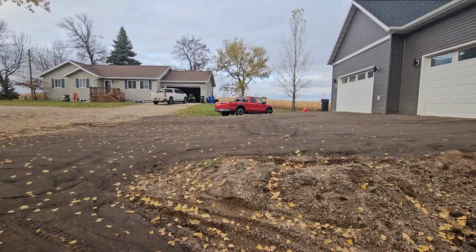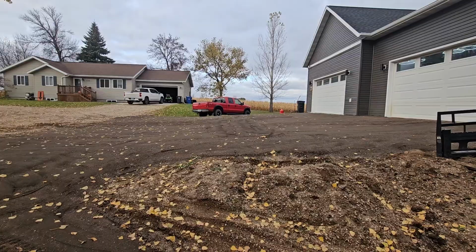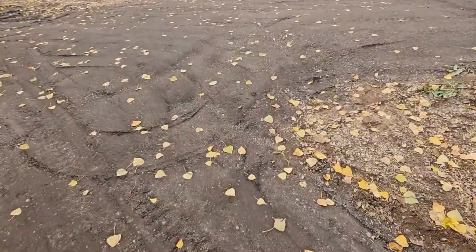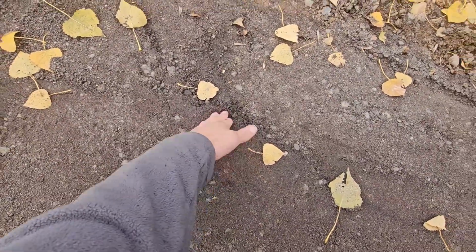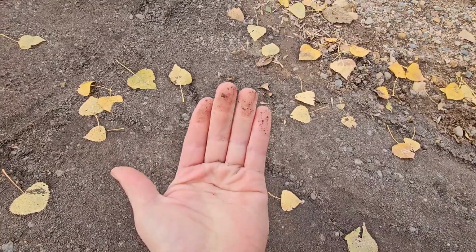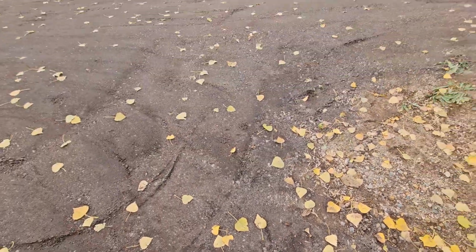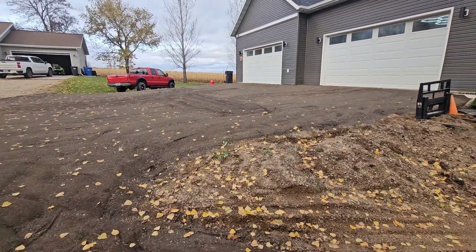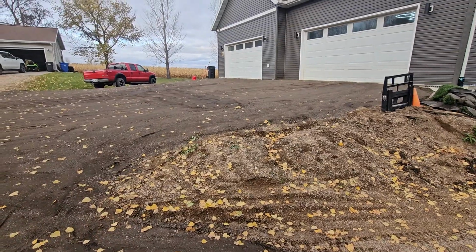because when you have crushed asphalt, obviously there's an oil that's mixed into the material. Well, when you go ahead and touch it, I'll just show you here. Let's just take this wet spot, for instance, see how nice and packed that is. But see this here? You get that little bit of oil staining on there. And I don't really want to be walking over this with my shoes or the cars and then constantly bring that oil and that staining into the garage.